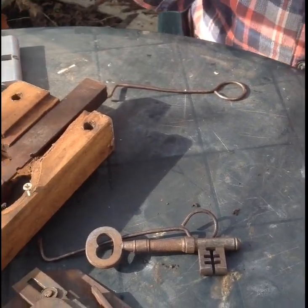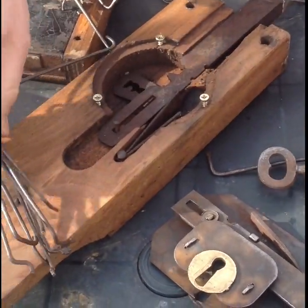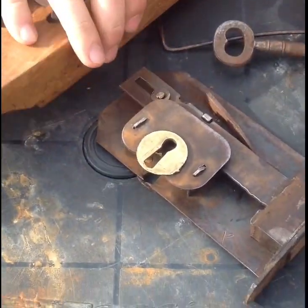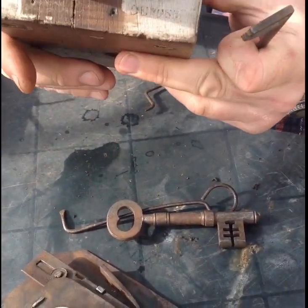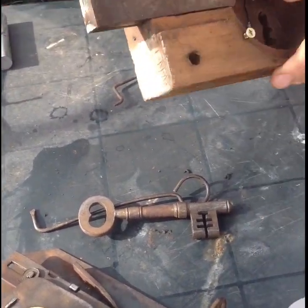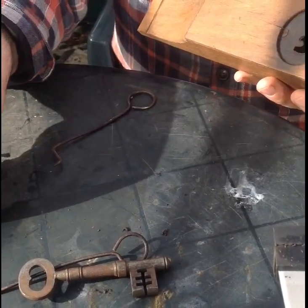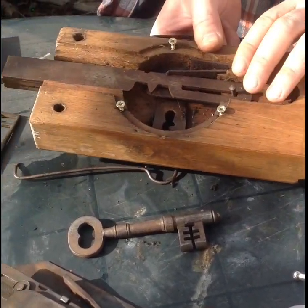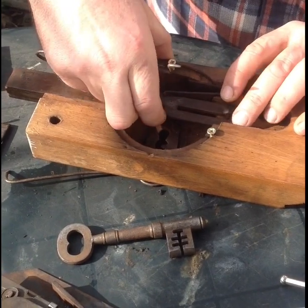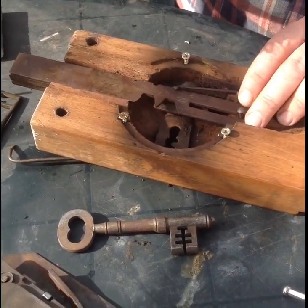Now the next thing wards were important for — you can see there's no wards in the outer keyway and how you can get a skeleton key in. This is a French lock. Now you might think this is a magic key that will open anything, but you can see they started introducing wards — you can't get this in. So to pick or open this you'd have to use a couple of tools. This is a one-lever lock, with the lever here, so it's a one-lever warded lock, warded in a different way.